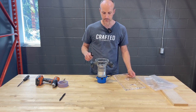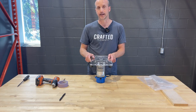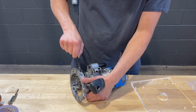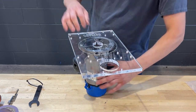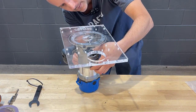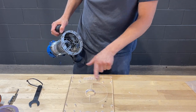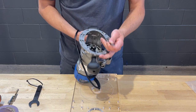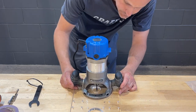I'm going to loosen up my router — I've got a quarter-inch flush trim bit in here right now. It's easier to use an eighth or quarter-inch bit to help find center. I'll loosen this up so I can retract the router bit so it's not protruding past the surface of the acrylic base, and then flip the whole thing over without worrying about it toppling. I'll lock that in place and put the Crafted Elements logo face side up so I can see it not reversed. Then I'll put the router down — it'll help if we re-tighten that nut — and confirm it's going to fit.